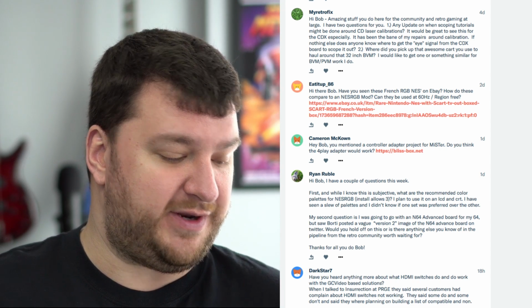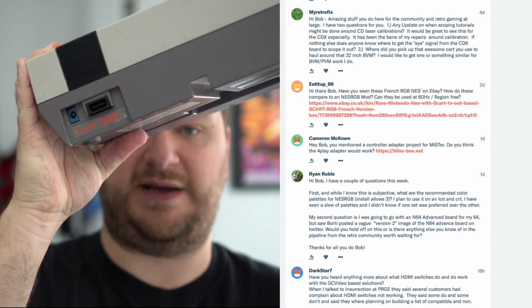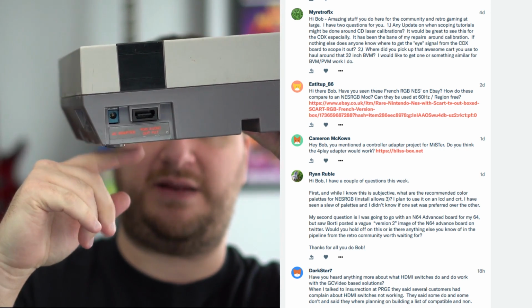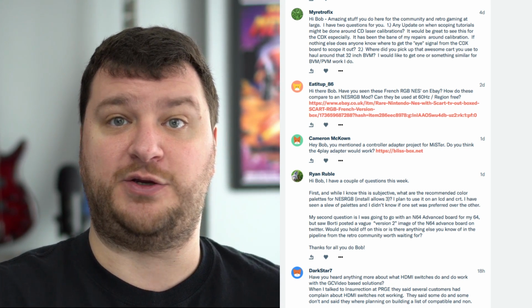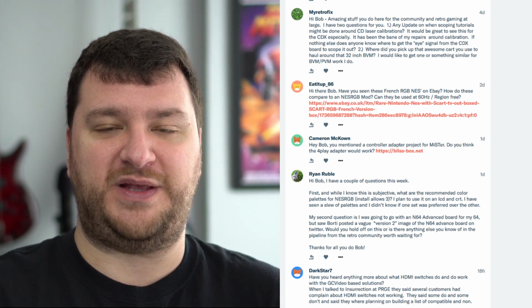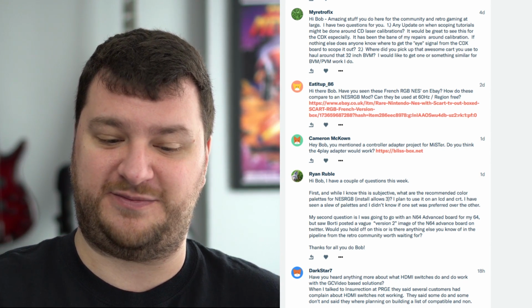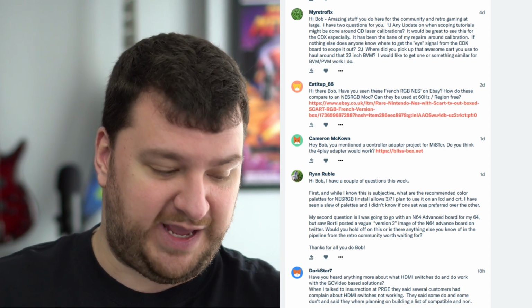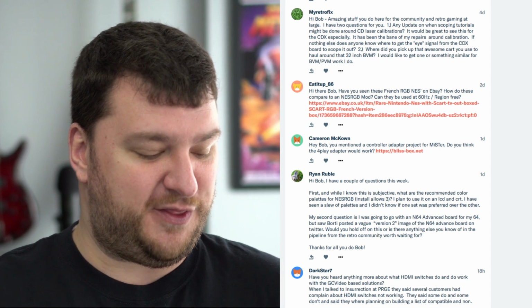The reason I wanted this is because I want to do one of two things depending on who I can get to help me. I originally planned on putting a PlayChoice 10 modded NTSC board in here with a full recap and the good board that you can get with the least amount of jail bars, so that I could have technically an official Nintendo RGB system, because it uses Nintendo's PlayChoice 10 RGB chip from the arcades. It would use their official cable and case, and I thought that would be neat.